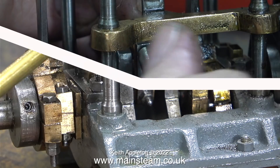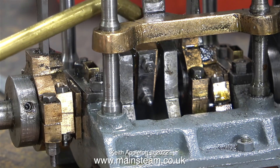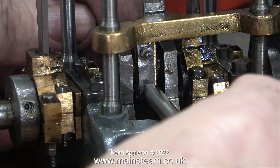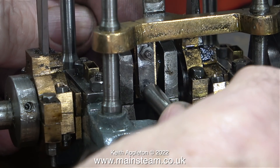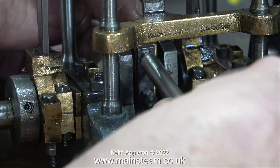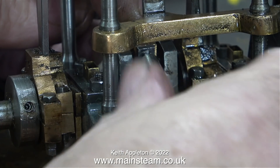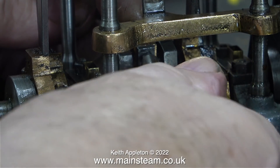Not all engines use this principle, but it's a good idea because gun metal is a very soft metal, and when the bolts are tightened the pressure of the nuts on the gun metal could cause it to distort. Here I'm showing how I fitted the nuts on — first tightly with a nut spinner, then I added a lock nut on each one of them, also using the nut spinner.